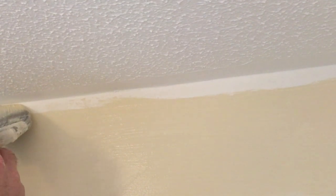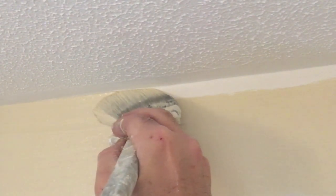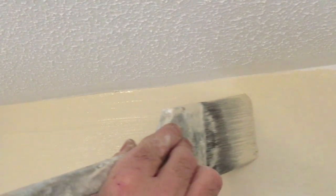I've left the inch at the top. Brush is fully loaded - get rid of any excess. Get the brush so you can see the straight edge of the bristles and just go very slowly, fairly steady on that edge. Come off and then just run back, just pull the line. Finish that process all the way along.